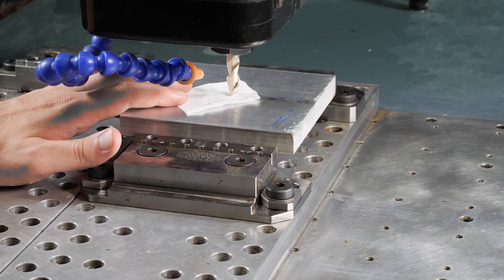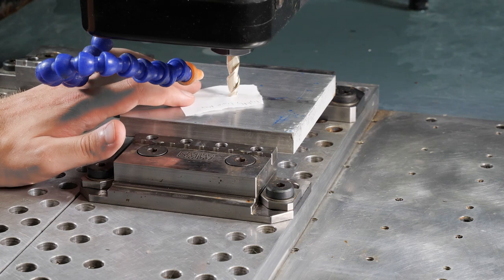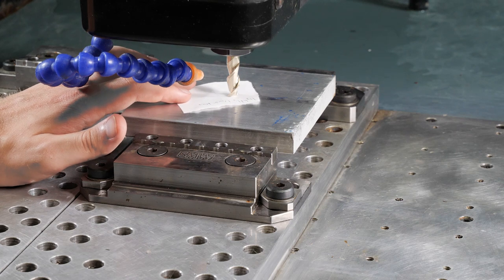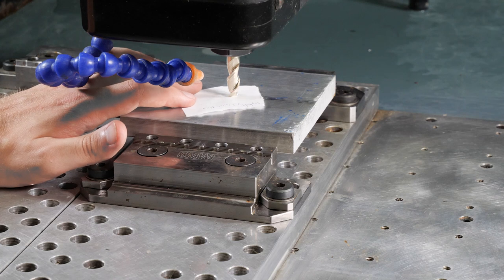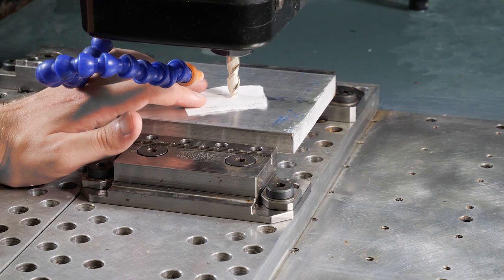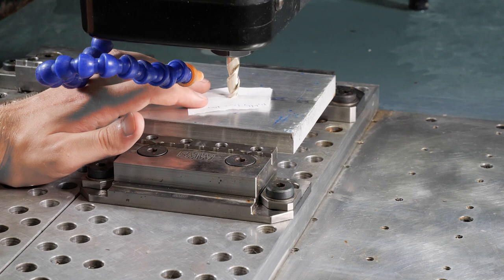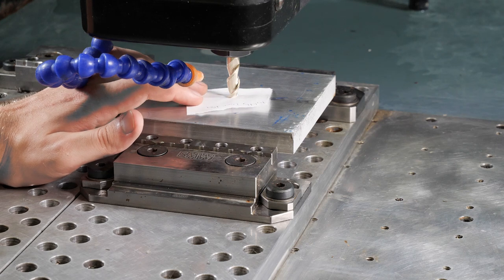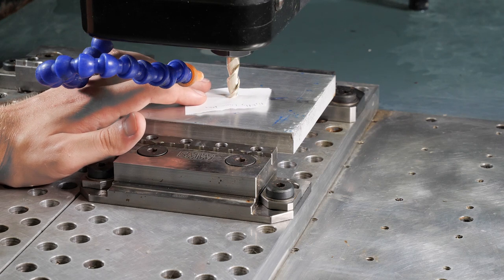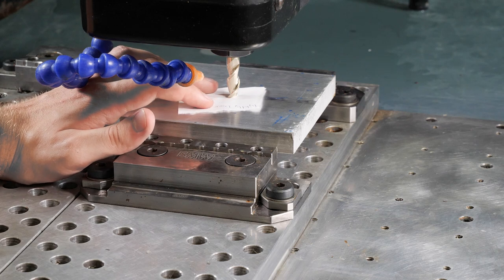I'm just gonna slide it back and forth, just so I know that when it gets to the top of the part, I'm gonna start feeling the tool catch this paper. And I'm gonna know that that's when it's hitting the top. This is kind of just something you get used to. Something the more you practice with, the better you get at. So right now, see, I can't move this paper, that's too far down. So I'm gonna bring it one step up, and that's about right.